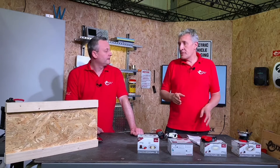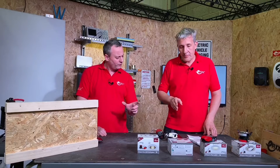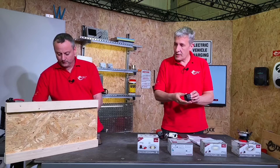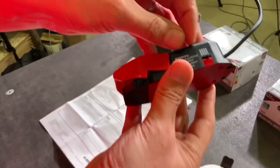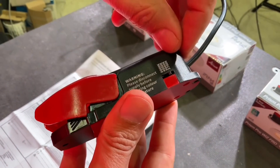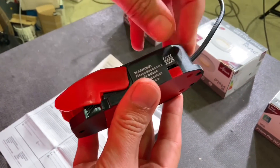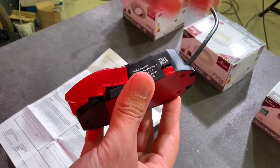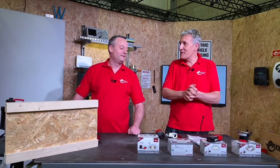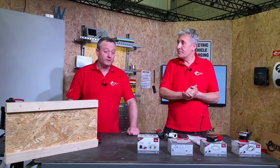That was shown in warm white. The range is available as fixed color temperature or selectable color temperatures set on the driver. On one version, there's a small switch on the side of the driver. It starts at 2700K — which not many products offer — and goes all the way up to 6000K. You set that on install. However, there's also an app-enabled version where you can tune the color temperature using the app.